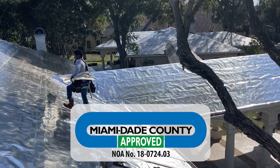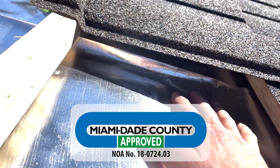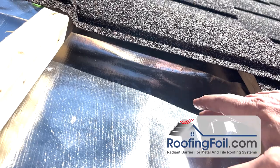When you use the roofing foil, it's going to reflect about 97 percent of that radiant heat, and so that deck below is going to stay a lot cooler — possibly 15 to 30 degrees cooler — and all that heat that's being reflected back is heat that's not going into the attic and into the house.